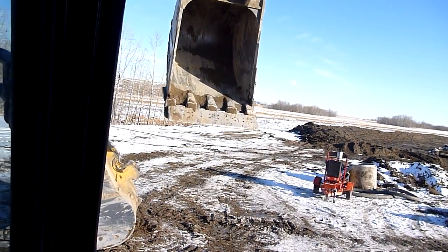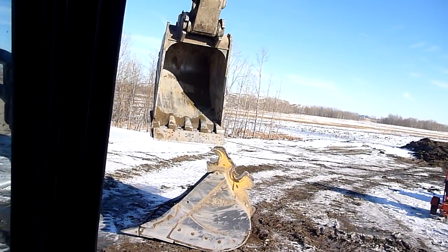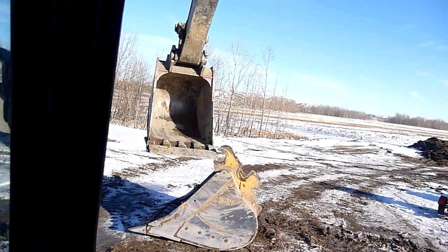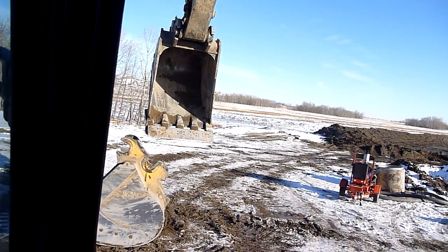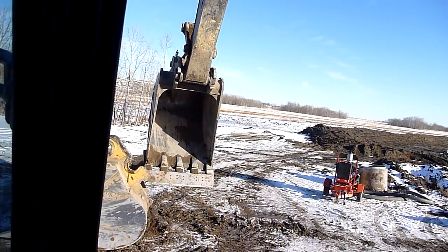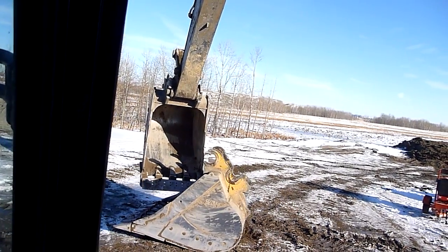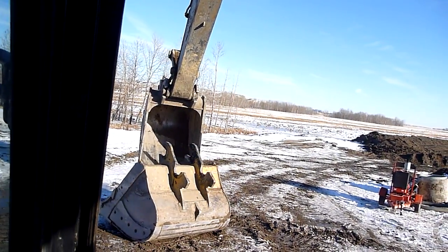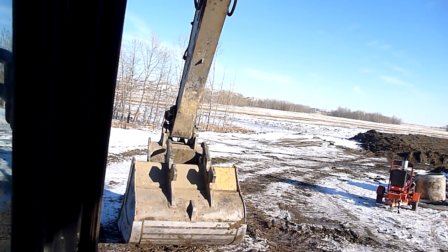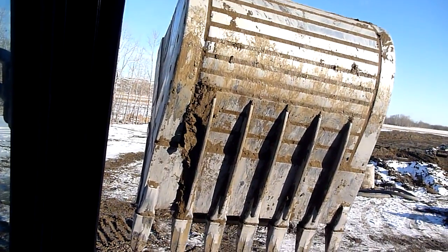You should be able to see the side profile of the coupler. Those front pins just go right in these ears here where my cutting edge is, the back pin goes in these half moons, and then the bar wedges in all the way in the back. It's a pretty simple coupler design. I don't prefer it as much as the pin grabbers, just because you lose a little versatility.